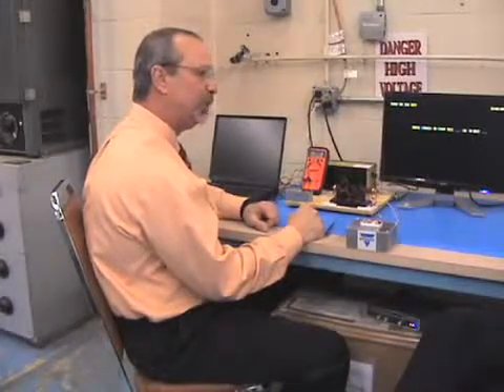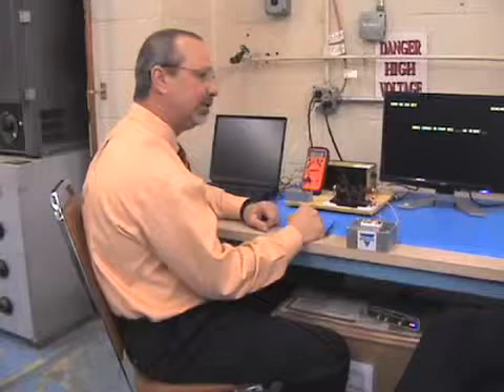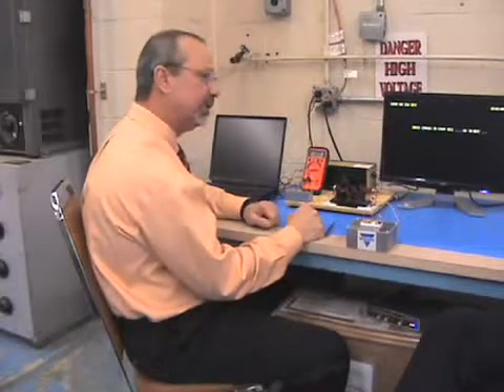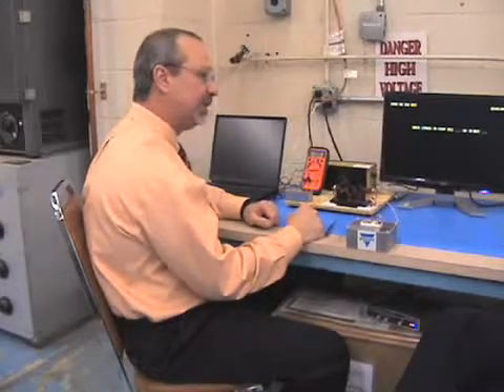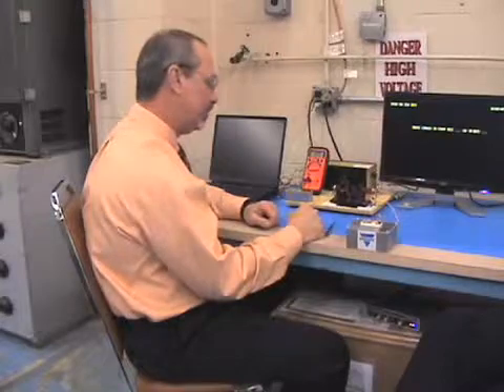Let's take a closer look at this. This test setup will measure and record the value of a test resistor, apply a 10,000 volt ESD-like pulse, re-measure the test resistor, and calculate any change in resistance due to the ESD pulse. I have a 10K 1206 size resistor from each of the major technologies: thick film, thin film, and foil.